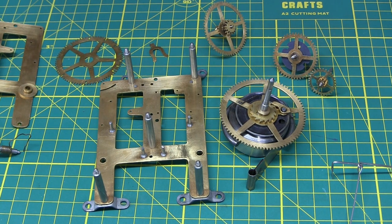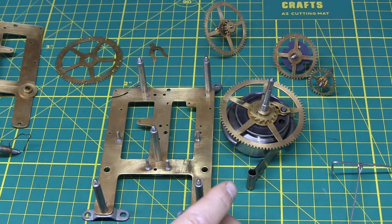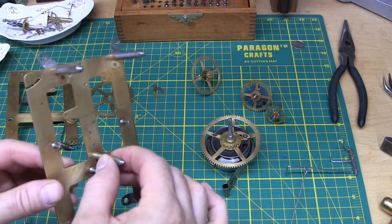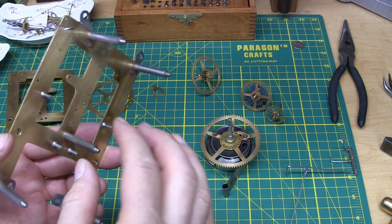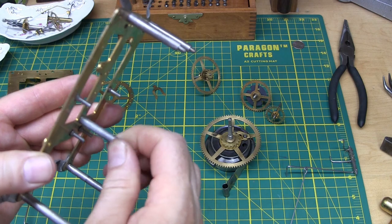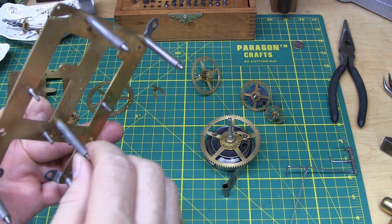Let's try to get this Seikosha clock back together. A lot of people wanted to see how to do that. The nice thing about the Seikosha movement is you don't need stands to put the movement plate on — it can just sit flat. This center post holds the pillar nut. Once the movement plate comes over, the nut goes on and holds the movement plate and gives stability to the center of the plate. But this one was loose — it moves around and it's just pressed on with this rivet.